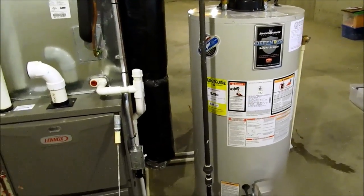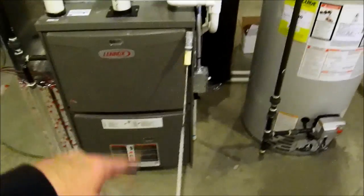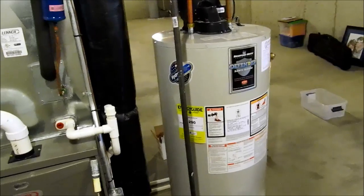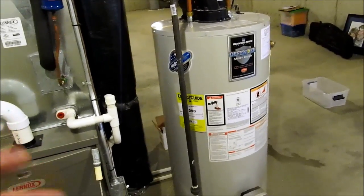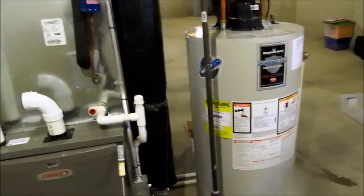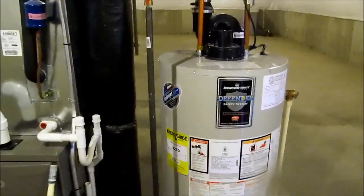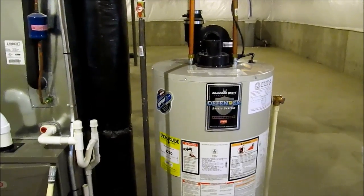Also, the one I put in here was kind of a hybrid rod between magnesium and aluminum, I think. I'm not sure, but it's a special, a little tougher rod, lasts a little longer. So that's what I put in this tank, and that's mainly out there on community well. So I thought I'd put the better rod in there just to make sure they got better performance.